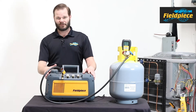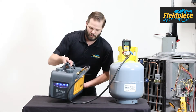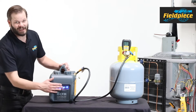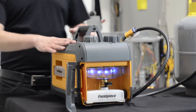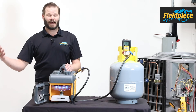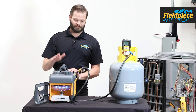One of the first things you'll notice about the VP85 and VP55 is just the look — it looks drastically different than your normal vacuum pump, and the biggest reasons are two-fold. We have a fan inside helping cool it down and allowing the pump to pump faster, as well as this oil management system on the front. The oil management system allows you to change oil on the fly while you're pulling a vacuum. As you pull a vacuum and the oil starts collecting moisture, your vacuum will slow down because it's not running as efficiently. So about halfway through the vacuum process, you can drain the oil while it's running and get new oil in there to make your evacuation faster.